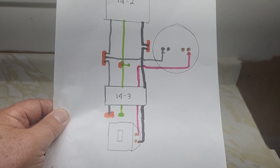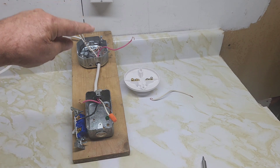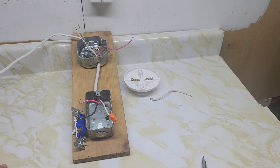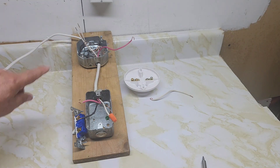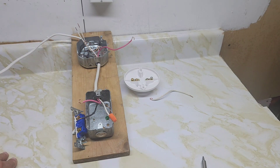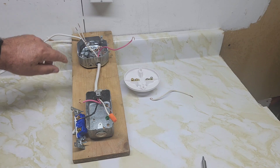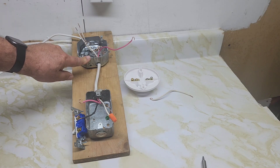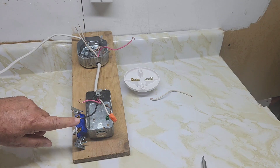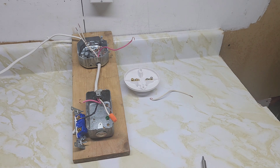So today we're going to show you how to wire power going to your light fixture first. You've got to bring power to the switch to control the light. Power comes into the octagon box where the light is, but you've got to bring power to your switch to control your light. What you need is power coming in — black and white and the ground — and then from the switch to the octagon box you need three wires: a black, a red, and a neutral. I'm going to show you how to do this today, step by step.